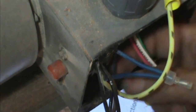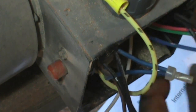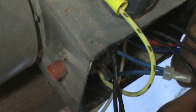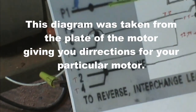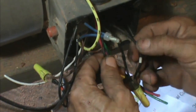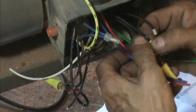Right now I've got these five leads going in here — one, two, three, four, and my fifth right here. Number two and number four need to stay connected out of these wires. One is labeled two and one is labeled four, which is the bottom of this diagram. I can see number four and I need number two as well, which I believe is this one right here. So this one and this one will stay in this bunch.